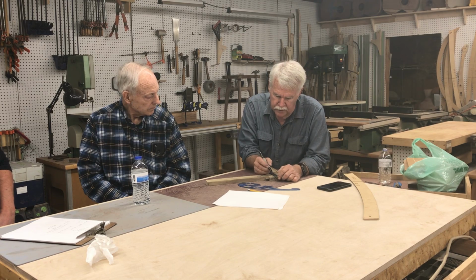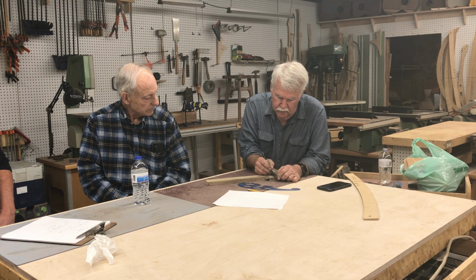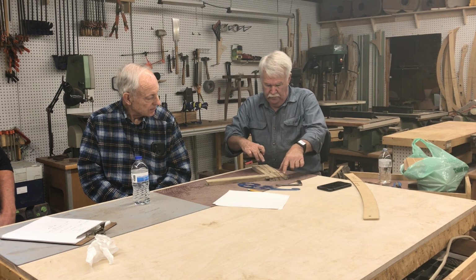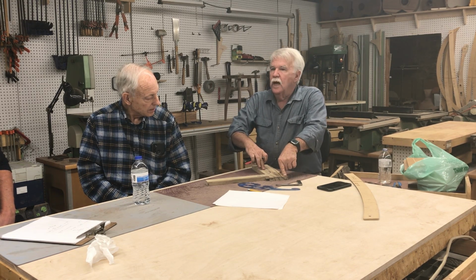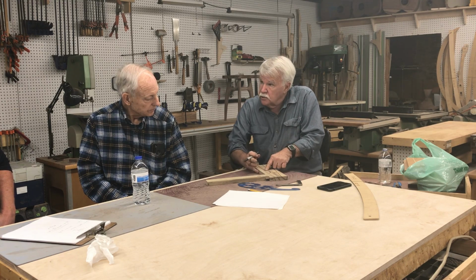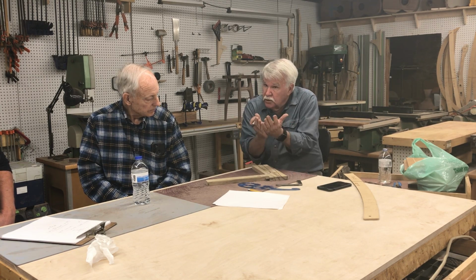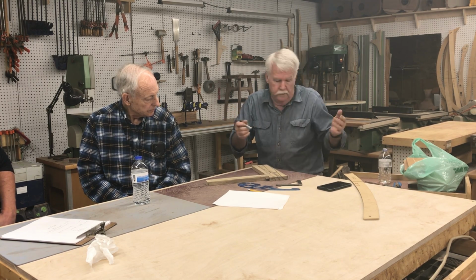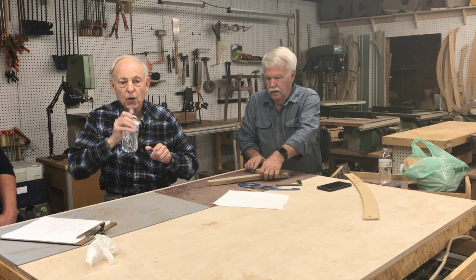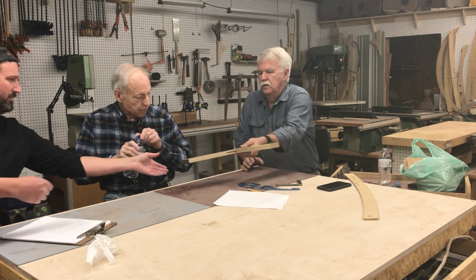Now, I'm also kind of stingy when it comes to wood, and if I were to do this, we've got waste right here and right here. I would lay it out so I could cut two legs out of this and actually use this surface to glue two pieces together and not waste the wood. Okay, let me tap that. And Kevin, if you want to just show.